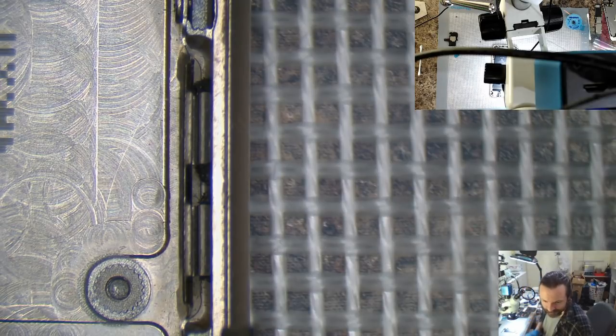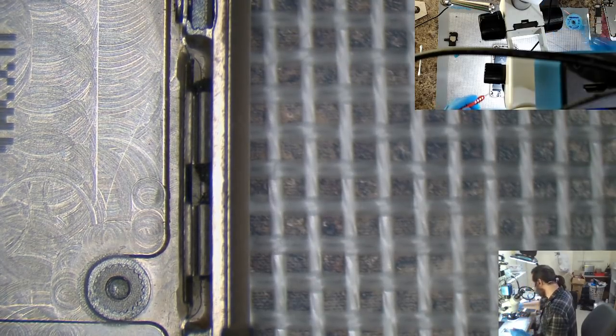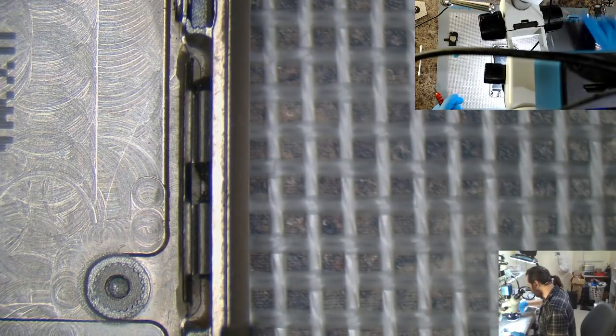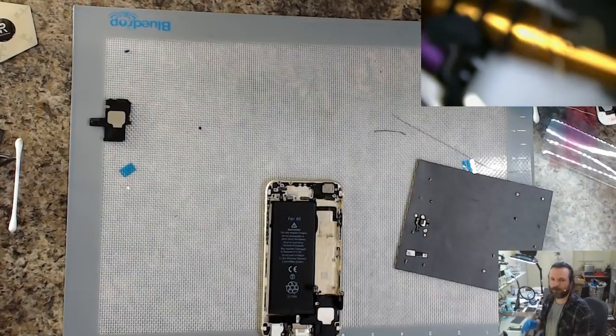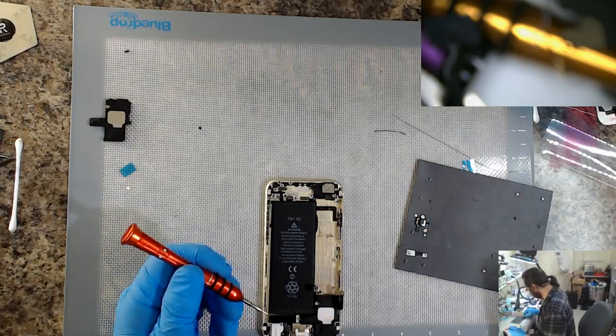Smarter every day. Yeah. I'm asking why nobody of the repair guys is using a benchtop multimeter. I actually do want to get one, but the trouble is the ones that you can afford generally have quirks with them, particularly because they come out of China. The Uni T ones, for example, are somewhat affordable, but you have to do stupid things. If you want to measure voltage, you've got to have your probes in one pair of sockets, and if you want to measure resistance, diode and stuff, you've got to jump to another pair. It's a pain in the butt.